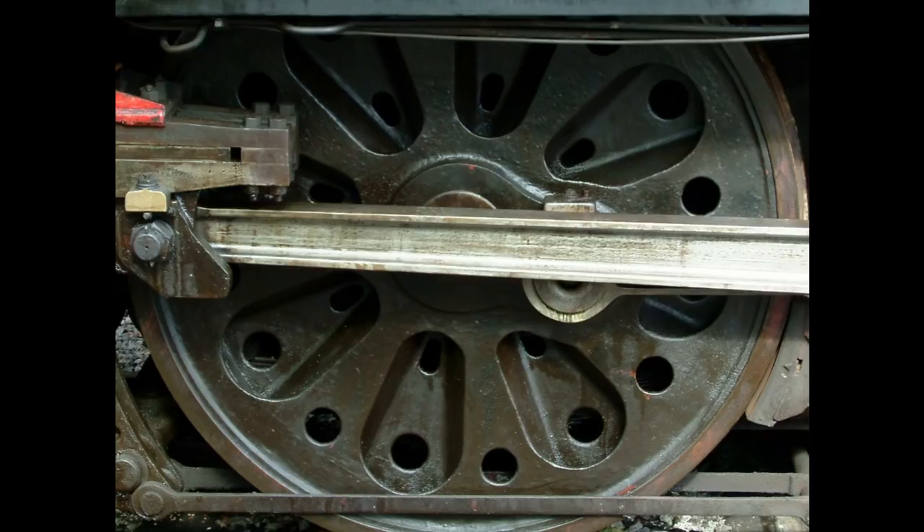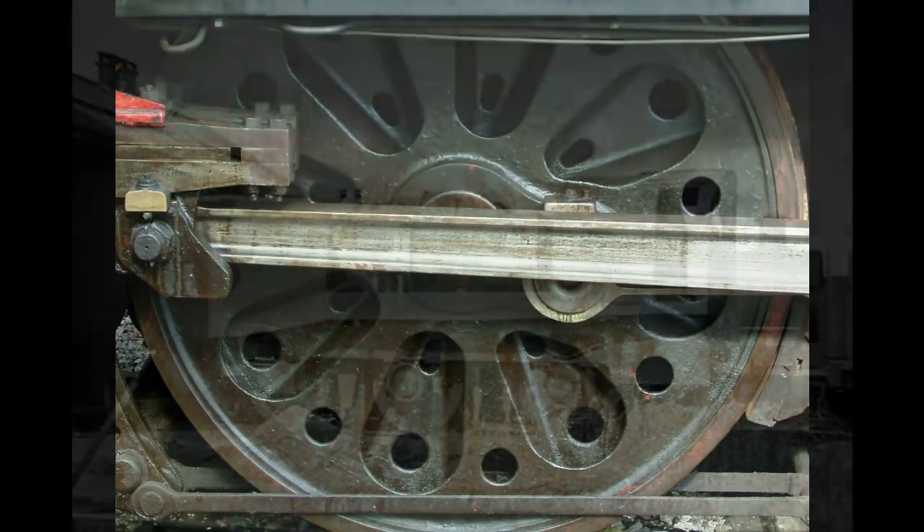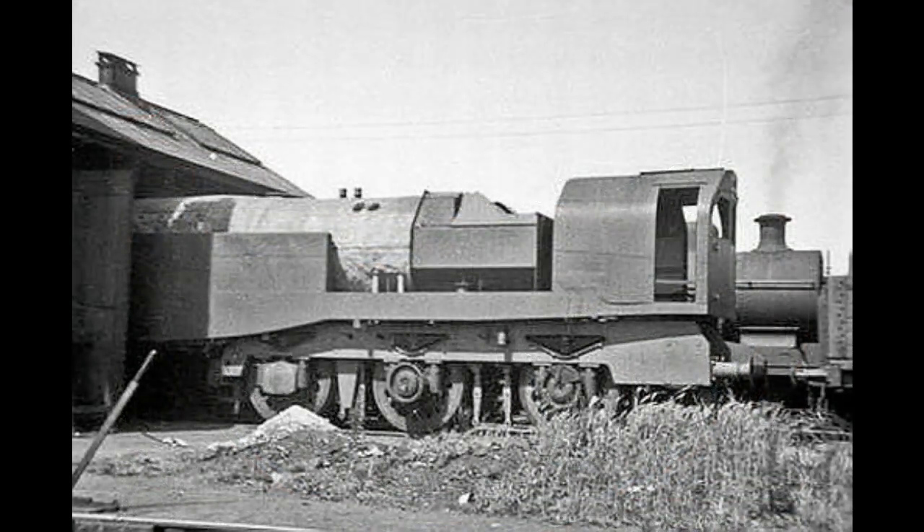The firebox was not initially equipped with a firebrick arch, although one was retrofitted during the summer of 1950. The arch was problematic, because it led to a tendency for flames to enter the cab at high outputs, a situation made worse by the narrowing of the firebox area. For ease of maintenance, the boiler, firebox and smokebox were encased in steel sheeting, which meant that the engine's shape resembled that of a modern diesel locomotive. The casing allowed the locomotive to be put through a carriage washing plant.